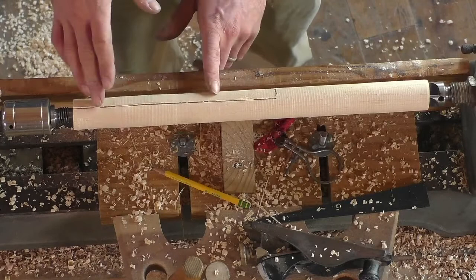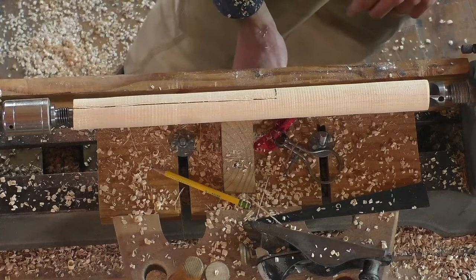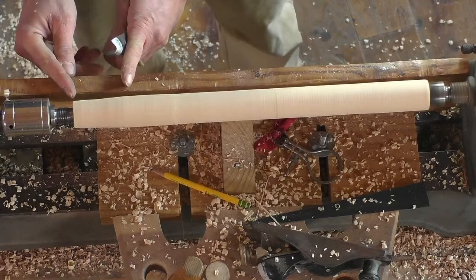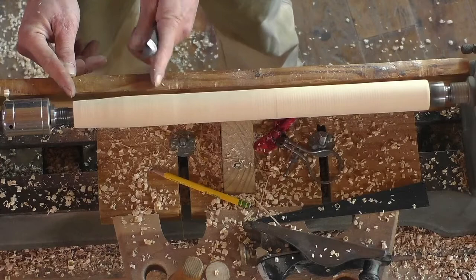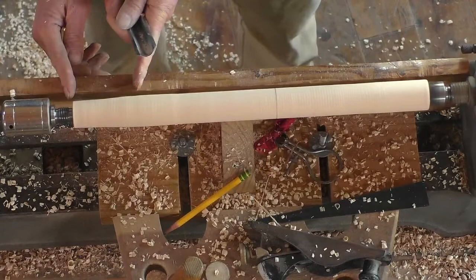What I usually do — I actually haven't made one this way in a few years; I'm usually doing it on the pattern maker's lathe — but I think I rough it down close and then use the parting tool. I'm going to start at this end where I have the most wood to take off. I've got what I think is a six-degree taper there, and now I'm going to start back further and keep that six-degree taper, working my way back up towards this pencil line. That's still six degrees — I've just made it longer now.